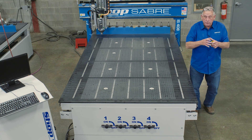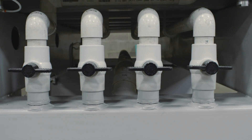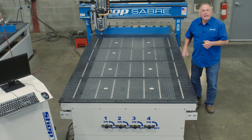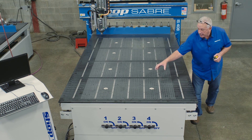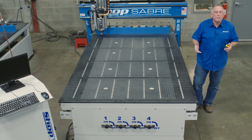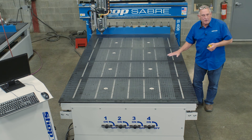You can tell from where those four ports were, they have valves attached. Those valves are connected through hard tubes to the ports on the table. The plenum itself is attached to a four-inch tube that goes all the way back. The machine is designed to get an incredible amount of vacuum to the parts — that's why these work so well.